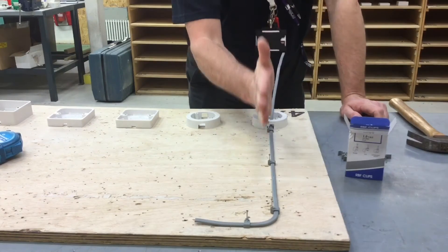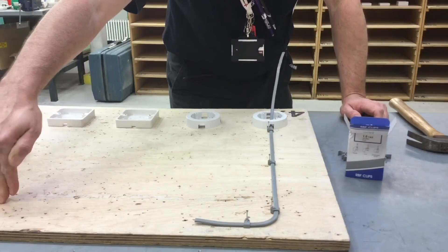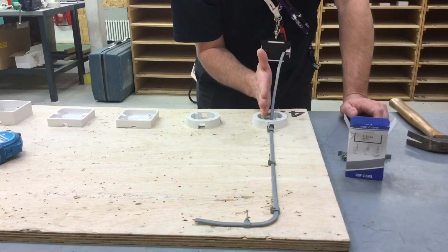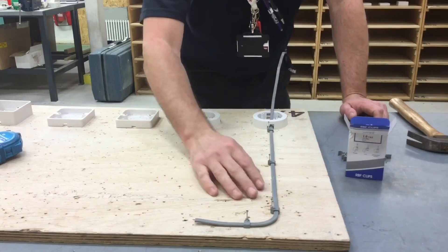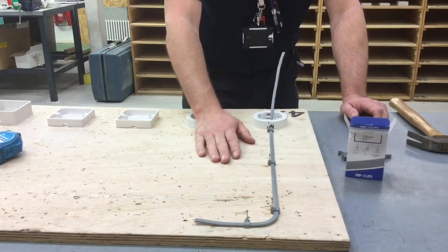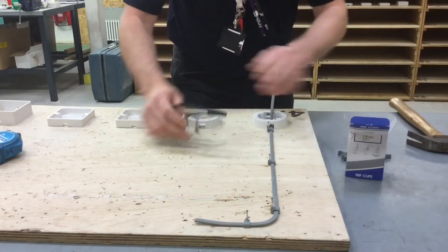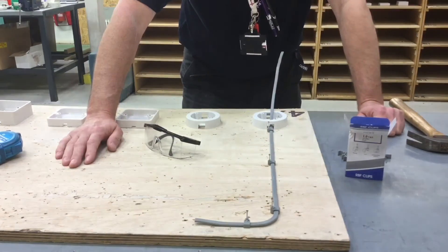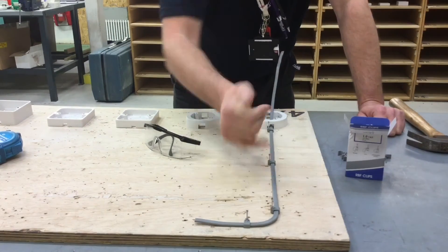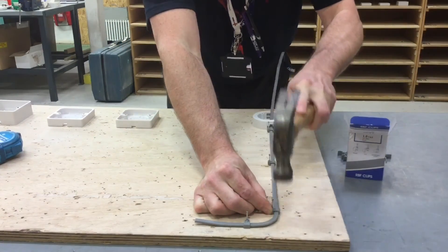I like the nails to run up the inside and follow it round the inside of the bend, and if we carried on, we'd keep going. I prefer that for supporting the cable, especially where we go horizontally. If I'm happy with it at this stage, I can now put them in. But before we bang those clips home, we must remember to wear goggles. It says on most of the boxes of clips that goggles should be worn because these nails can shatter, especially where we're clipping them into the course of brickwork. So we're going to make sure our goggles are on, and now we can send home these clips.